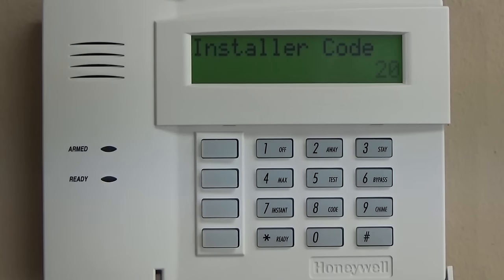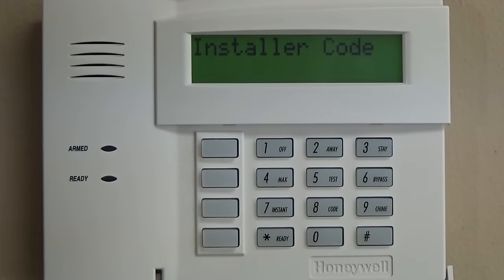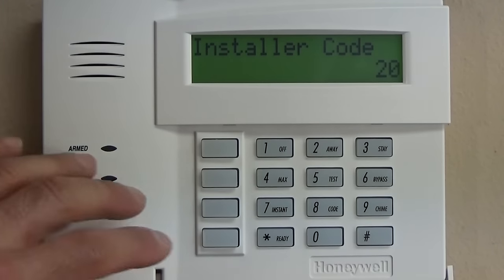That you would use over a 6160 RF in case you have a large dwelling, a large unit, and you want to centrally locate it. The distance for these is typically pretty good, but in some larger houses where you might have 5,000, 6,000, 7,000, 8,000 square feet, you want to try and centrally locate that receiver to reach the furthest one instead of biasing this towards an entry door and then having the entire distance for the wireless contact to try and talk back to this.